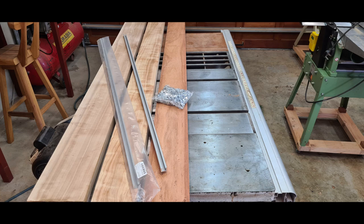The one I'll be building now will replace both of those. The components you can see on my table saw are what I'll be using for this project. On the left-hand side there are two pieces of poplar wood; on the right-hand side a piece of Rhodesian teak. The poplar I'll use for the base of the jig — you can also use MDF. The Rhodesian teak is for the fences; it's a very hard-wearing wood that I think will last a long time. There's also an assortment of bolts, nuts, wing nuts, and two T-tracks.